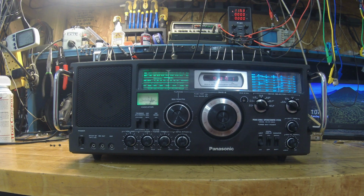Anyway, I know this has been a pretty long series, and I wanted to get this last video out. I'm really excited with it. I've been playing with it quite a bit, and I can tell you I see why it's a coveted shortwave radio. It's got some amazing ears, and it's really stable. It doesn't seem to drift a whole lot, especially for being an analog like it is. If you own any of this type of radio, you want to let it warm up for a good 30 minutes to an hour before you go surfing, because it'll be a lot more stable once all the temperatures stabilize on the inside.